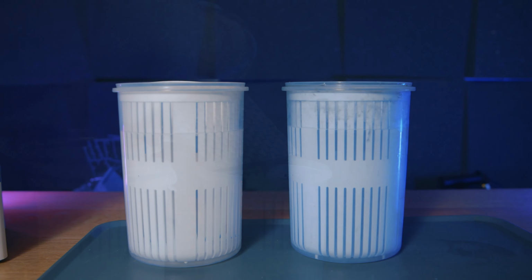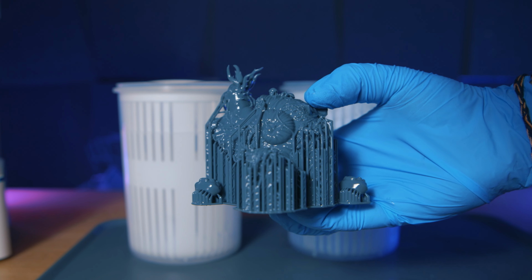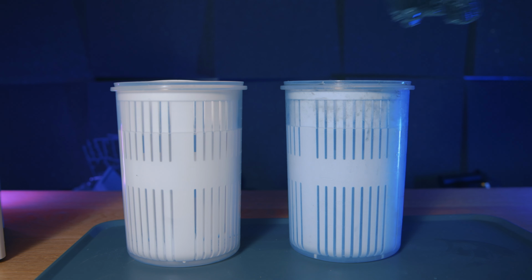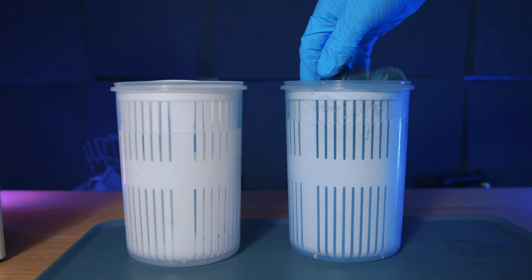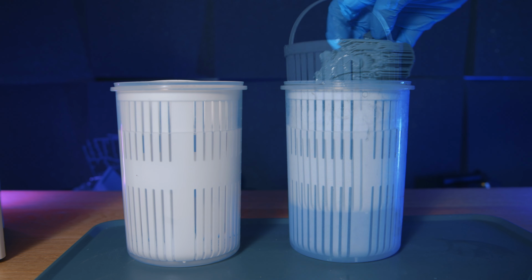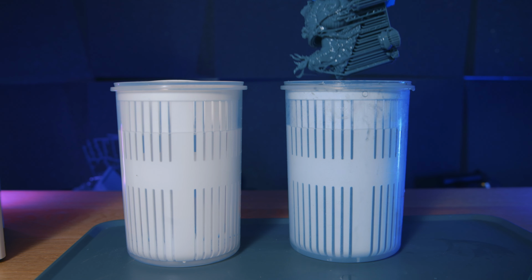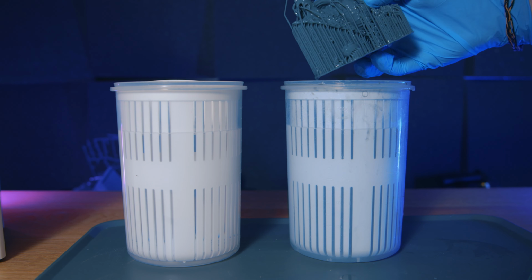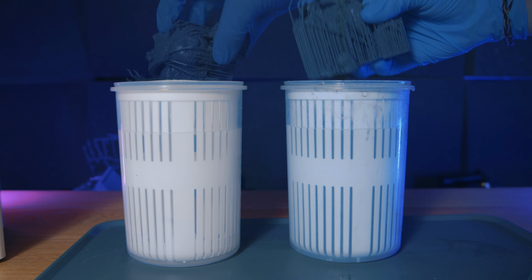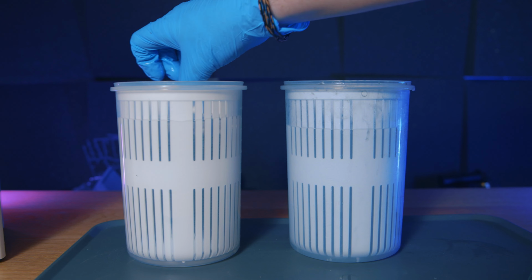So in order to work out how long I need to post-cure it for, I need to go, okay, let's say this print was 5,000 layers and it was 1.5 seconds a layer. So it got to 70% after 7,500 seconds of curing time. So that works out at around 125 minutes. In fact, I think that's dead on. And then therefore 30% of that, let me just check the calculator, is 37.5 minutes of curing time, which for any print seems incredibly excessive.